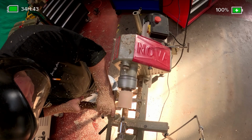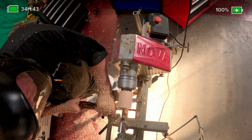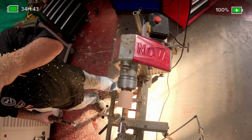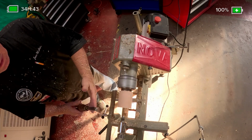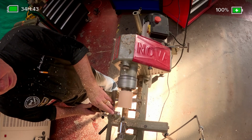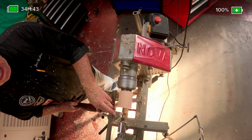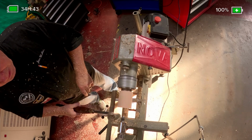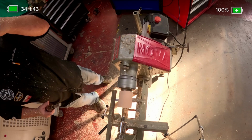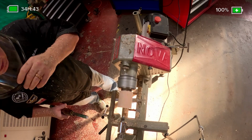That's why you wear a respirator. And what I've used is a peeling action. I come up, start up here. As I start to peel, I'm pushing in, but I'm raising my right hand. Okay? Now that I have that, I'll make my tenon for my jam chuck.